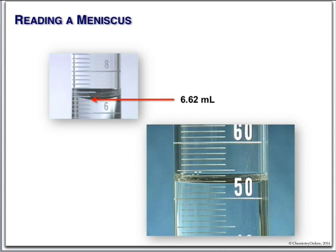Now what you were working with was a 100 mL graduated cylinder. Again, here's our meniscus. It's the negative meniscus. So we're right there. And if we were to read this, this is 50, 51, 52, that's 53. So it's just short of 53. I would do like 52.8 as a read.